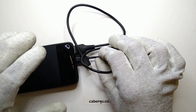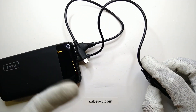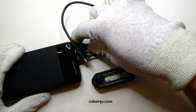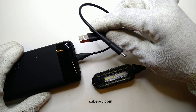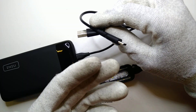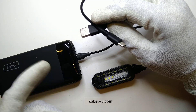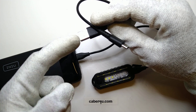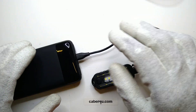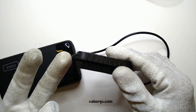And for you as a user, it's really unintuitive because you have two cables and both of them are identical. The USB-C one can even be better in terms of power or data transmission, but for some devices they just don't work. So that's why I started with: oftentimes you are on the safe side by using the USB-A to USB-C cable, because those are the simple ones. They don't have any fancy features, they don't have power saving applications in mind, they don't have power delivery negotiations going on. They cannot define the direction in which the power is flowing — it's always going in this end and out of this end. But if you don't know much, then probably that's better for you. And only if you know what you're doing can you use USB-C to USB-C cables and just know that this device won't work with that.